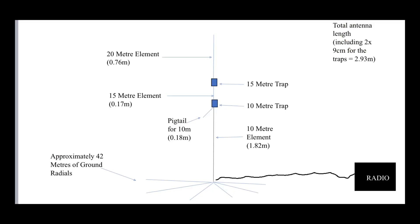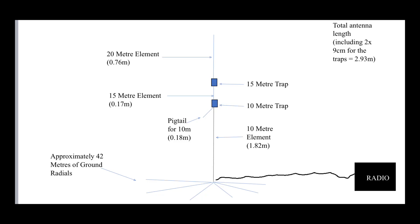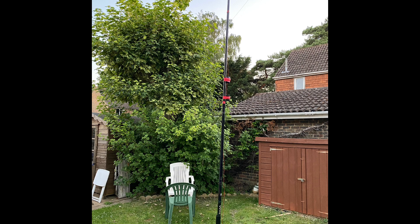Let's have a look at the design. The antenna is a three-band vertical for 10, 15 and 20 meters. It uses one wire with some traps. What a trap does is it basically stops any RF for that particular frequency. So you've got a trap for 10 meters — 10 meters only goes up as far as that trap, including the trap itself, because it also provides some loading for 10 meters. The 15 meter trap stops 15 meters at that point, and 20 meters flows all the way up the antenna.